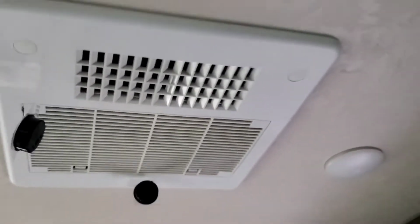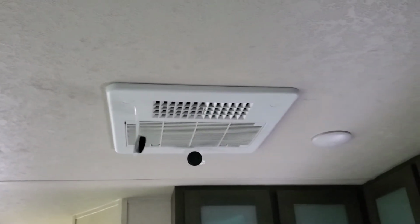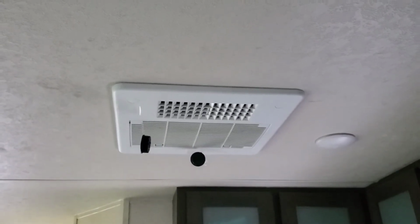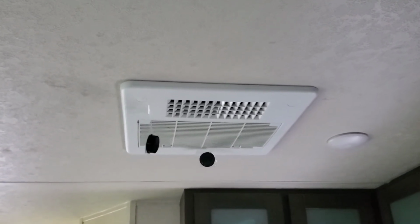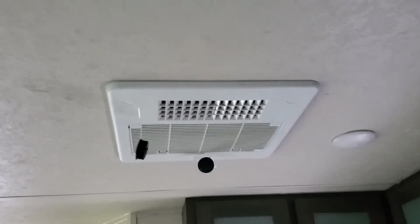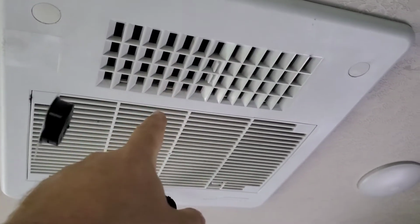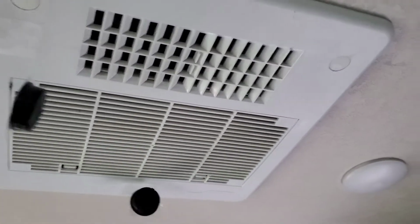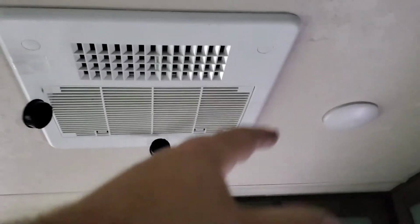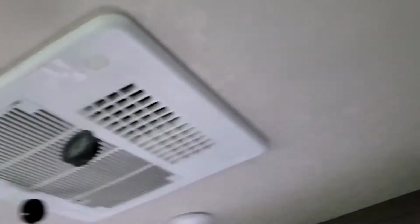Another thing I noticed when I was going through all this testing, when I put that AC on the roof, we ran it without the white bezel on. And that did a couple different things. Without it on, you're getting a straight dump of cold air. I mean, way more powerful than what I feel here. These louvers really reduce that airspeed dramatically, at least what's coming straight down. Okay, now with that on, I am super slightly pressurizing my air ducts in the ceiling.